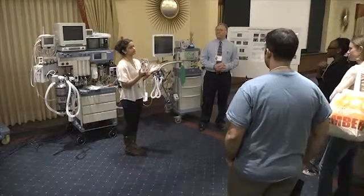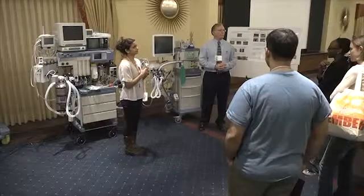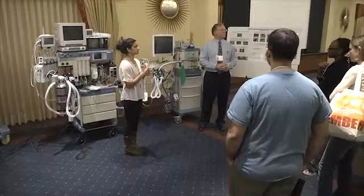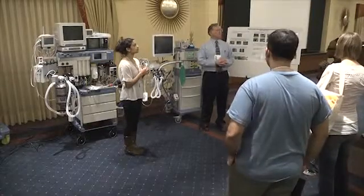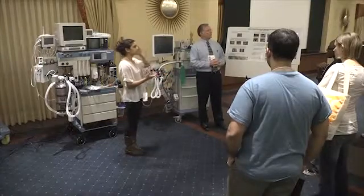What are you looking for when you check your tank? When you're checking the tank in the back, why are you doing that? You want to see that it's at least 1,000 PSI. And what does that tell you? Why do you want it to be 1,000? What's that magic number? Does it tell you the amount of time or the amount of oxygen you have? The amount of oxygen you have, like 330 liters.